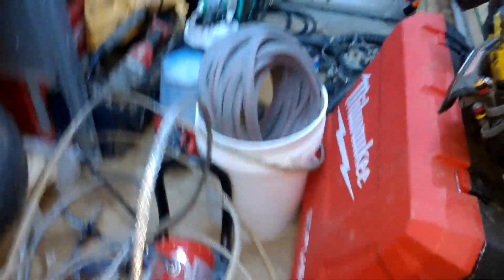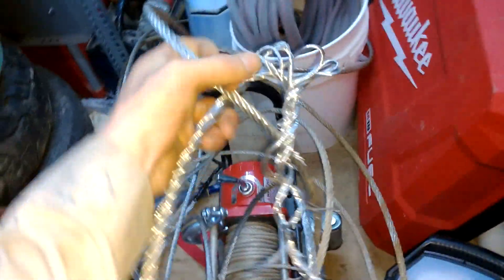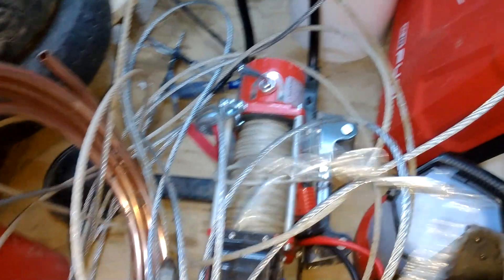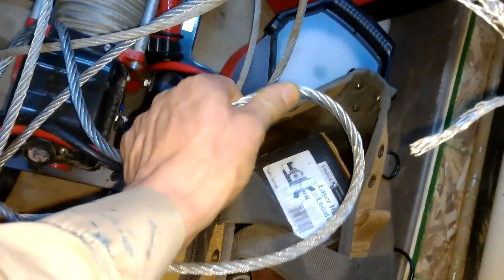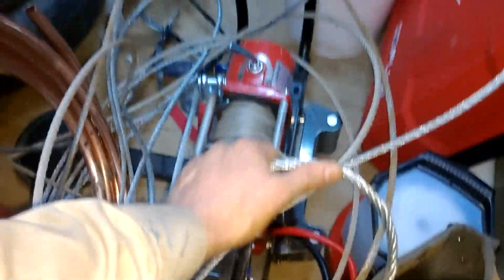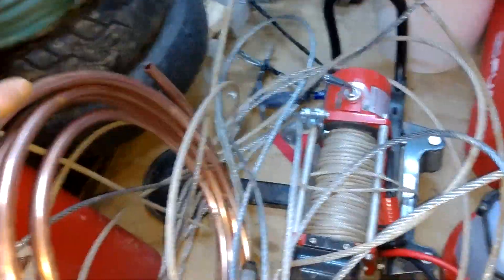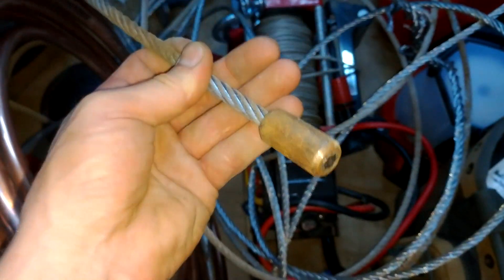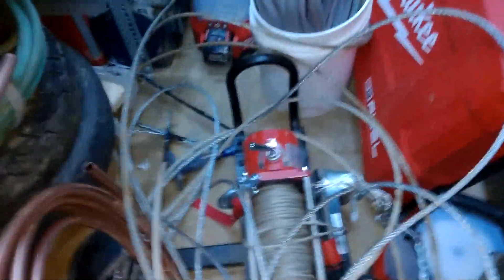This is what happened when I used a cable pull that really wasn't designed for this — it basically cut and mushed it through and cut it right at this point, and it did this twice. Once we realized we needed it to go around like a smooth point of attachment with some radius to distribute the force applied on the cable, that's what we did on the excavator, and we were able to really start pulling it through, and then it eventually started pulling the line out itself. So they had a half-inch water line and now they have a three-quarter-inch copper line — upsized and got rid of their leaking galvanized at the same time. The swedge stayed intact — it did not budge — so they knew what they were doing when they put it on the end. It was able to take the full force of the pull.